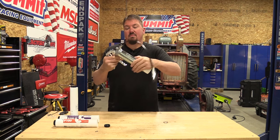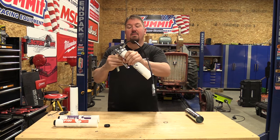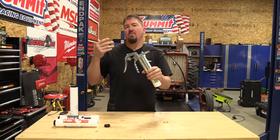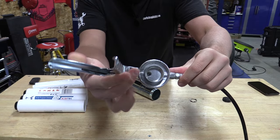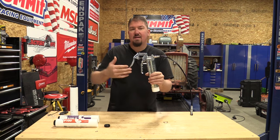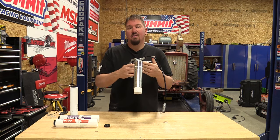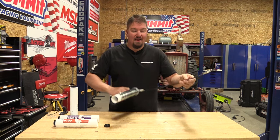Simple solution: just remove the cover on the top. That allows you to completely get your hand up here and remove it — no issue. You don't need to have it in that tight. Next, if you have the pistol grip, lever grip, or any of them, you need to have the piston come all the way back. If you take short strokes and don't let that piston come all the way back to grab more grease, you will not get any grease coming out. Just take a full stroke — no issue. You can think about the dynamics of it and you'll completely understand why that has to happen.